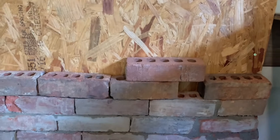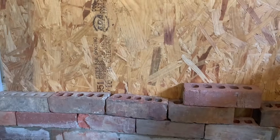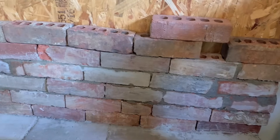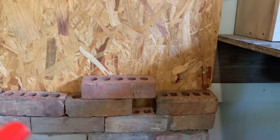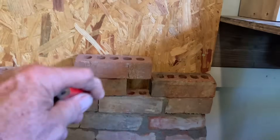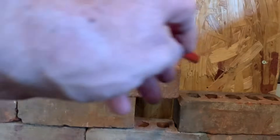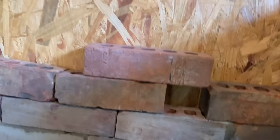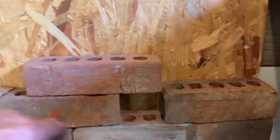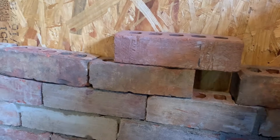Mainly just the vertical coming up. I'm going to probably start making my mortar a little bit thicker between each brick layer. I made it fairly thin down there. I'm going to cut that brick — what I'll do is lay out about three rows of brick, cut them, and have them ready. Then I'll lay them on the floor out of the way in order they go. I'll put another layer across there, get my mark, and cut them. I try to do about two or three rows at a time, lay them in the order they go. So when I'm ready with my mix all mixed up, I put my mortar on there, put the first row on, then mortar again, then put the second row on. They'll already be cut and I don't have to worry about my mortar getting too dry.